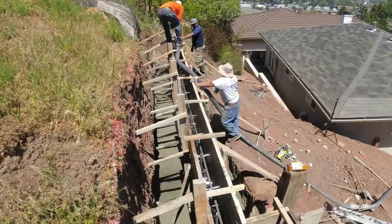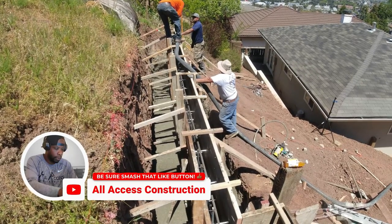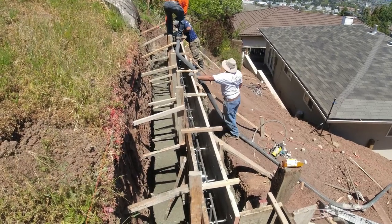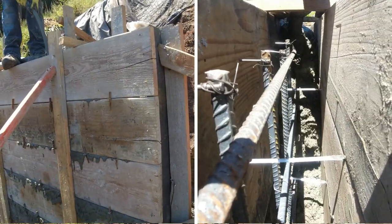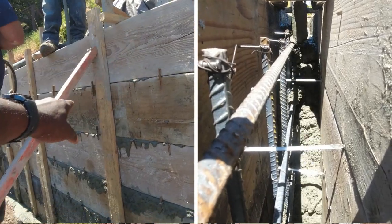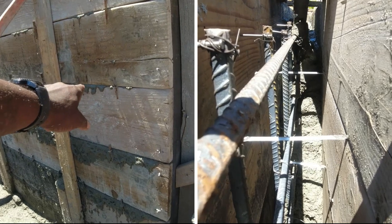Just like the footing, we go from one end to the other. Normally we'll fill the concrete wall up somewhat to the top, but as we vibrate — as you can see here — it kind of comes down and slowly spreads throughout the wall. So it's not filled all the way up to the top; then we go to the next part of the wall and kind of start almost like a triangle.